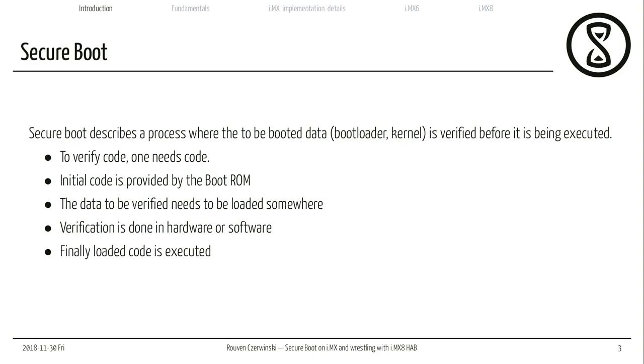Is the boot ROM verified? Hopefully. I have no access to the boot ROM at all, so I can't interchange it. It's shipped with my processor and it's unchangeable — it's always there. It's a ROM, read-only memory, so I can't touch it. When we say verified, we mean cryptographically verified, not proven to be correct. It can do cryptographic verification, but nobody says the boot ROM is actually working correctly or that somebody verified it — and that's also something you run into, but that's a different problem.